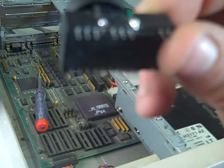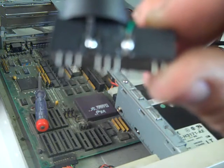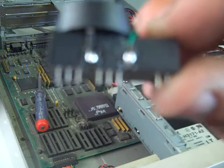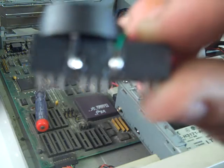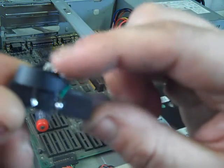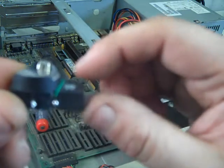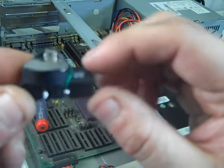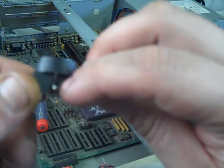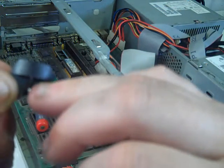And it's a standard off-the-shelf chip, and what they do is they bend certain pins up. Namely, what you've got basically is a complete clock minus a battery supply and a clock crystal in that chip. So they bend the relevant pins up, and then on top they stick, where my finger is here, a clock crystal to the top of the chip, and about where the battery is, about there, they stick a 3-volt battery inside, and then encapsulate the whole thing in this plastic. So what you have to do is you mill away at it until you can reach these pins. And on this side, which is the positive leg, as you chip it away, you can actually see the pin bent up and then soldered to the battery.